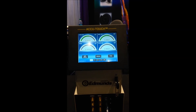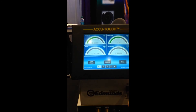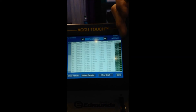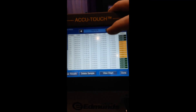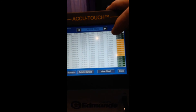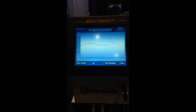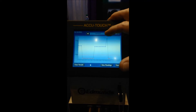Now I need to document what I'm doing. At the simple press of a button, I am putting digital data out to this USB memory stick right here. If I want to look at that data, I can simply hit the button and I have a time and date stamp of when the measurement was recorded, the upper and lower spec limits, and the result of each of the features that I'm measuring. The AccuTouch can measure four features simultaneously, so I can scroll through and see what each one looks like. I can also give the operator a very simple run chart of each feature, where he can see what the process is doing in a very rapid manner.